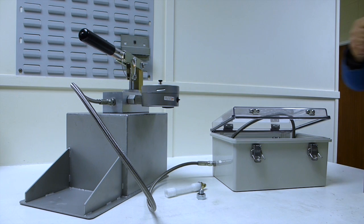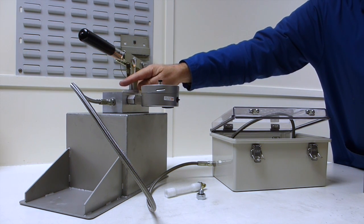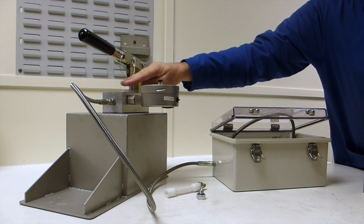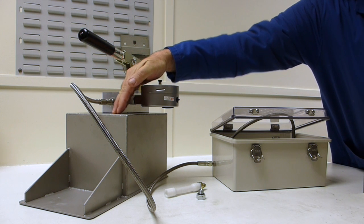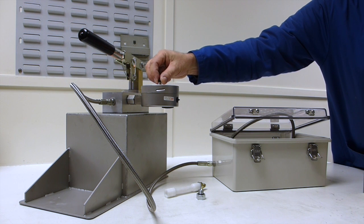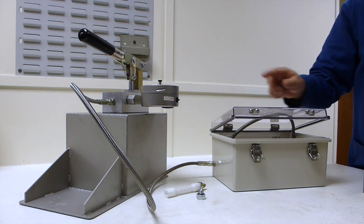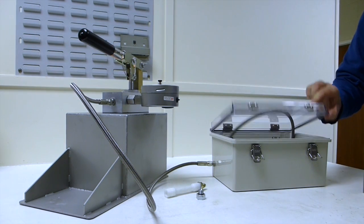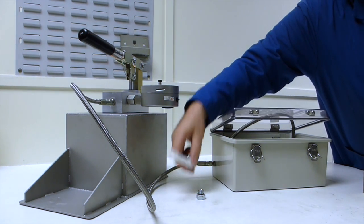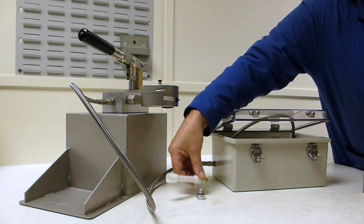What will you need? Firstly you'll need some sort of pressure test pump. We're using our Serum Hydraulics Micropack hydraulic hand pump used on water — hand pump, reservoir. You'll also need a pressure gauge; in this case a drag pointer gauge with a pointer that indicates the burst pressure. Finally you'll need a containment chamber to contain the burst, and you'll need your test piece. This is a plastic moulding, but it's your job, so whatever your need is.